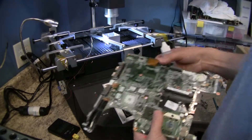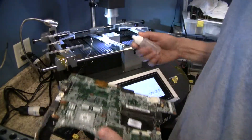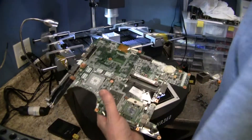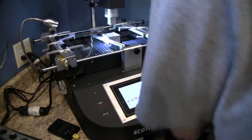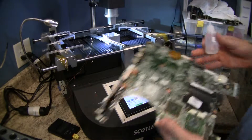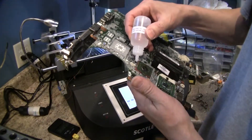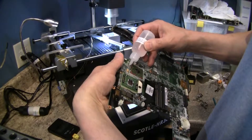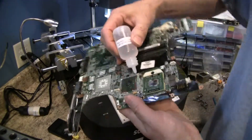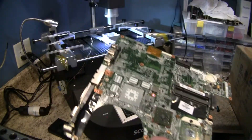This is the continuation of the DV6000. We've pulled off our plastic protecting layers. We're going to go ahead and get ourselves fluxed here. This machine's already been profiled for a DV6000, so we don't really have to hook our probes up, because we've been running these boards by the dozen. So we're going to get some flux good in under that Nvidia chip.